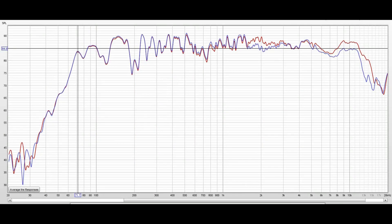Here are the frequency response plots of both LX5 II speakers, taken with the covers off. The measurement is made using a calibrated microphone placed one meter away, on-axis, pointing between the tweeter and the woofer/midrange, with one watt of input power. The sound pressure level is about 85 dB at that reference line.